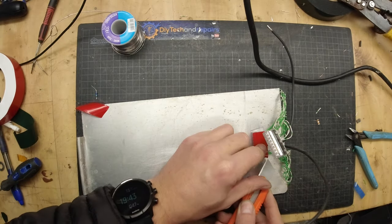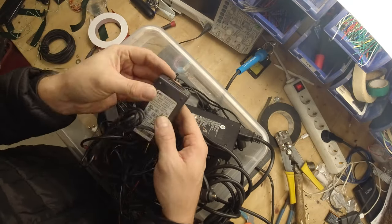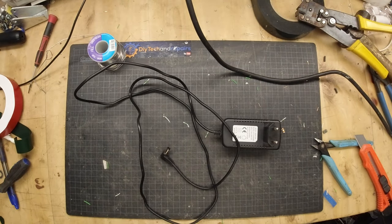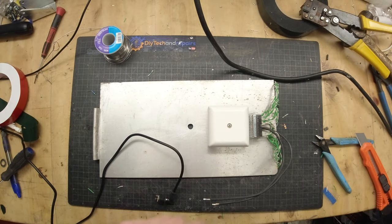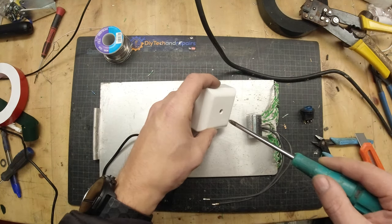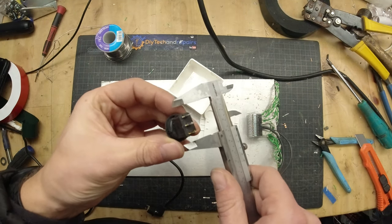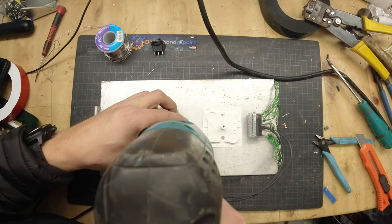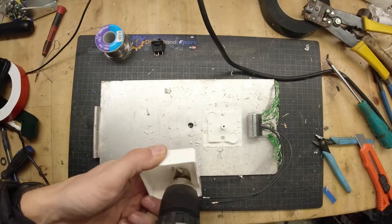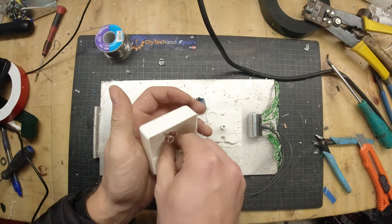Before that's done, I attached wiring on the back side. I found a PSU that could give me two amps, and that's what I'm going to use. I also found a box to house everything in. I need a button to turn it on and off and to show the state of whether they are running. I'm measuring the switch to make sure I know how big a hole to drill, then using a step drill to make quick work of it, and popping the switch into place.